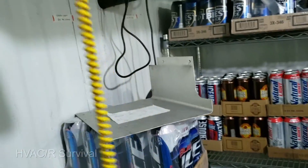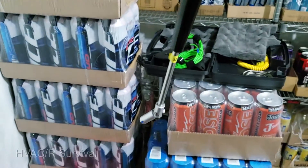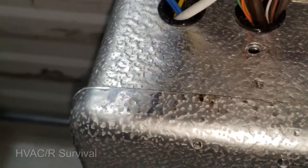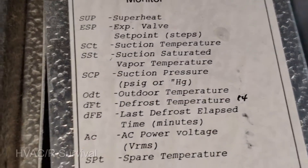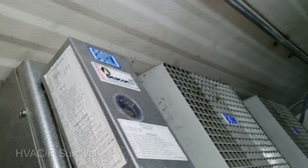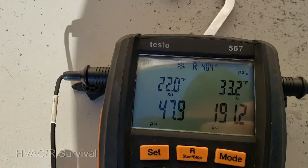This here is a Cooper Atkins probe, part number 50418-K, American made. They're not cheap, but they do a great job — I'm really happy with them. One last thing I don't want to forget: that's my suction pressure. Since this controller is calculating superheat, you've got to make sure the suction pressure — SCP — is accurate. If that's not accurate, it can't calculate superheat correctly. Both units are showing 5 psi. It just pumped down, so temperatures and pressures are correct. The sensor is now wire-tied into place on the side so it should not move. That finishes this one up.